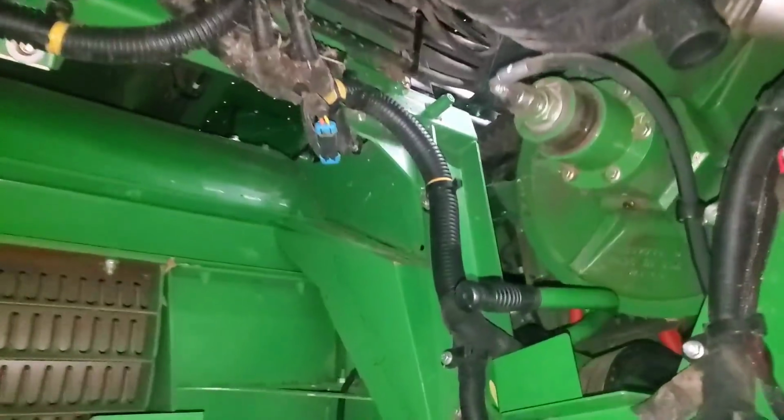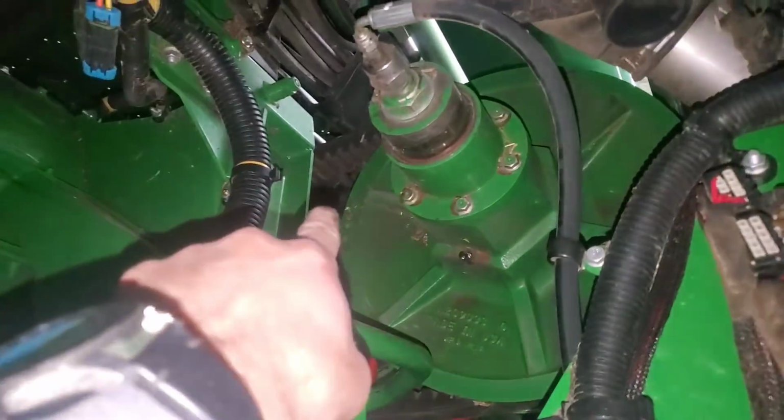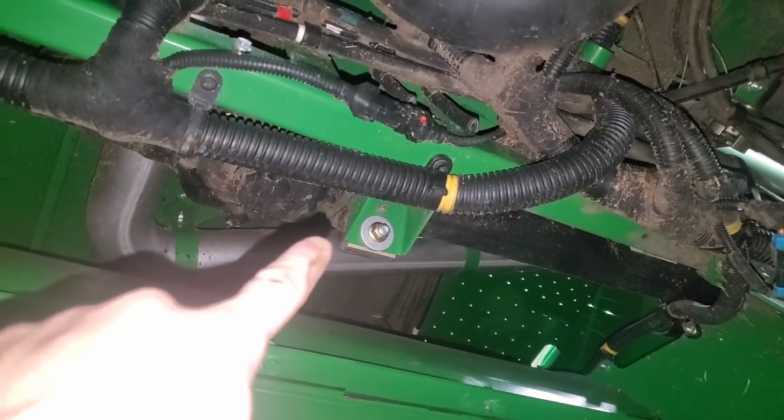All right. Took a little crawling around, but I did in fact find all 5 of them. There's one up back there on that U-joint. There is one on that U-joint as well as on the bearing right there. And then there's another one, the first one that we found, on that shaft right there, and another one on that U-joint. So that shaft is greased.